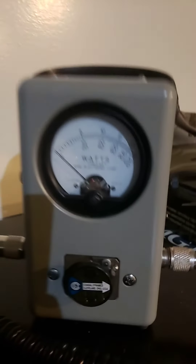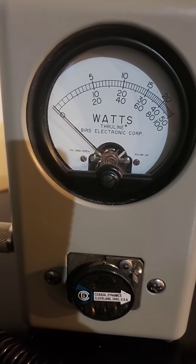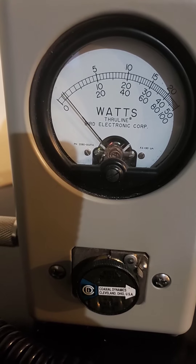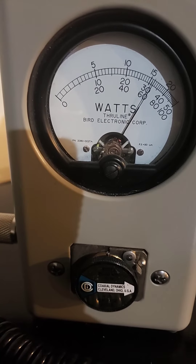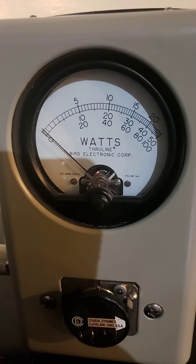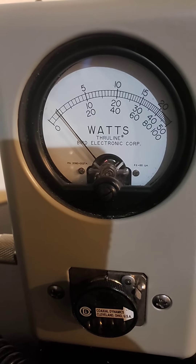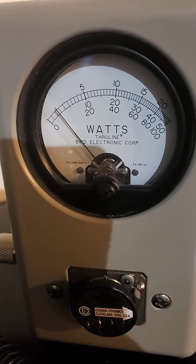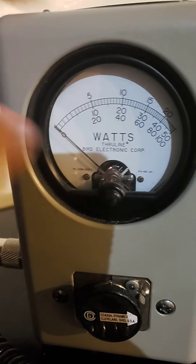Let's see how this one does. It's a 25 watt slug. Variable all the way down — about three quarters of a watt, maybe. I've got the multiplier on, let me fix that. So that's weak for this radio. There you go — so a little over a watt on the carrier all the way down. That's two and a half. So we're down here around a watt.